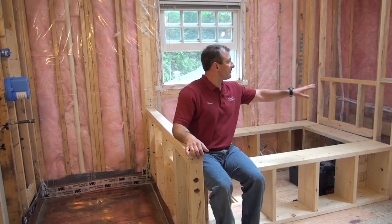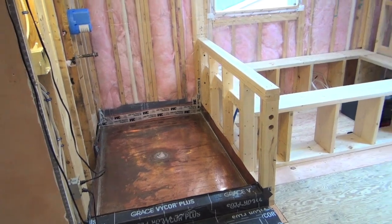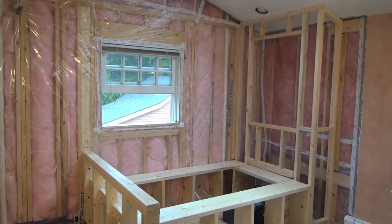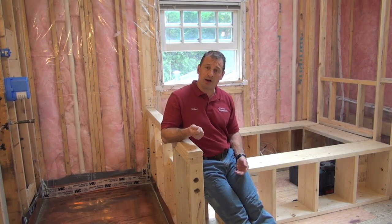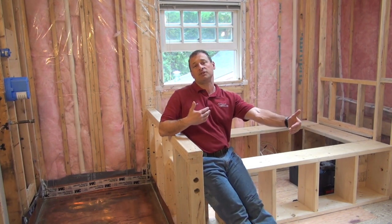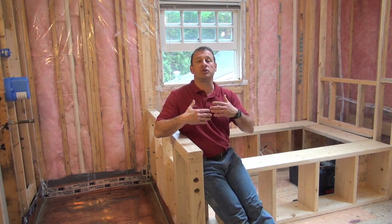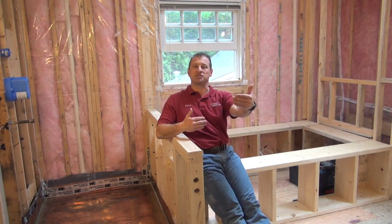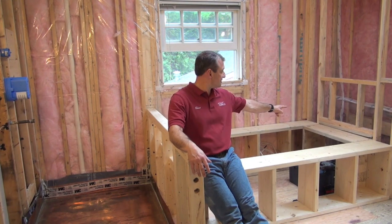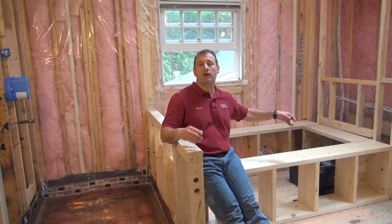As for the rest of the room, there's a little build-out here. We're going to do some sort of built-in — originally there was talk about a television, but now we're doing a recessed cubby for storage. That brings up a good point: when you're ordering your tub, think about the orientation of your drain, because where you sit is usually opposite the drain, especially if the faucet comes out of that side. You want to orient the tub in the way you want to face when you're laying in it enjoying it. Our back is to this side so we couldn't put a TV here — if we turned the tub around, we'd have had to rework the drain.